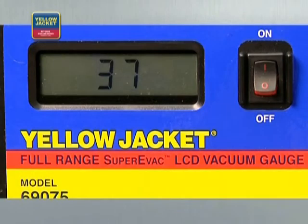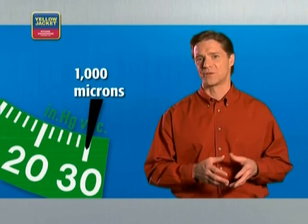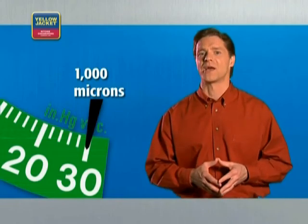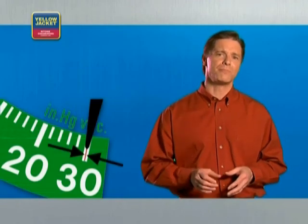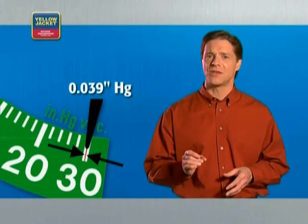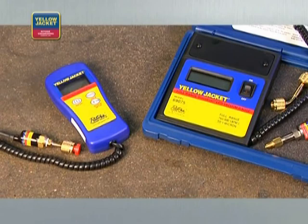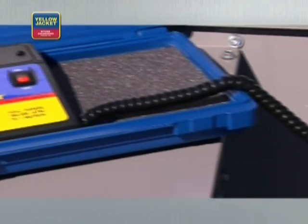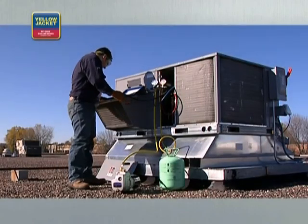There's no way to know when you have pulled an adequate vacuum without an electronic vacuum gauge. ASHRAE recommends evacuation to below 1,000 microns, and after isolation, a system must not rise above 2,500 microns within several hours. 1,000 microns equals only 0.039 inches of mercury — a measurement that cannot be made with a mechanical gauge or determined by evacuation time or the sound of a pump. The only tool that can measure vacuum at these levels is an electronic vacuum gauge. With an electronic vacuum gauge, the technician can see the last evidence of moisture being removed and witness that the system has dried out.